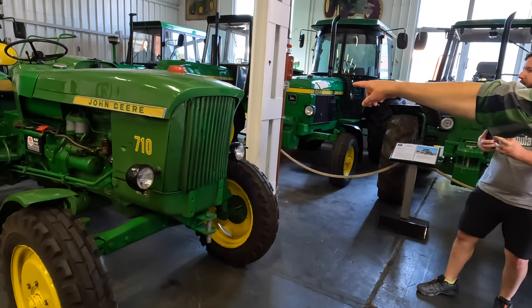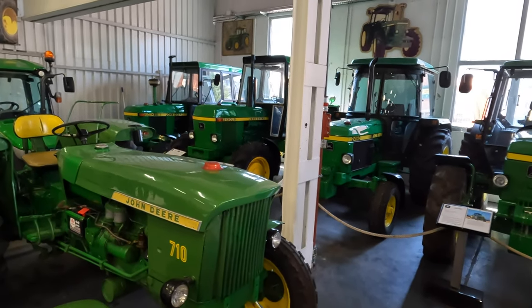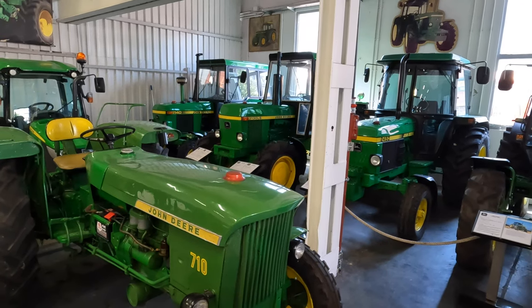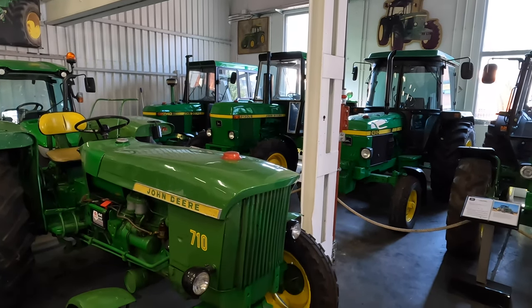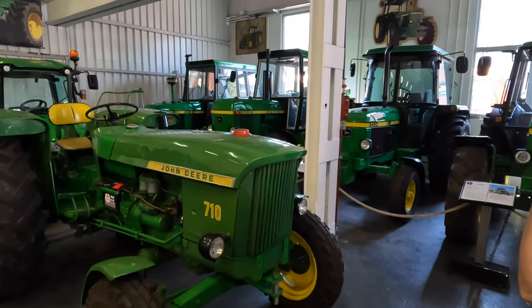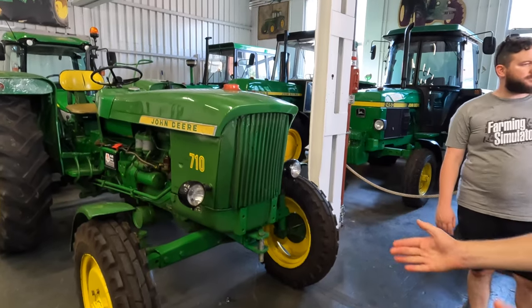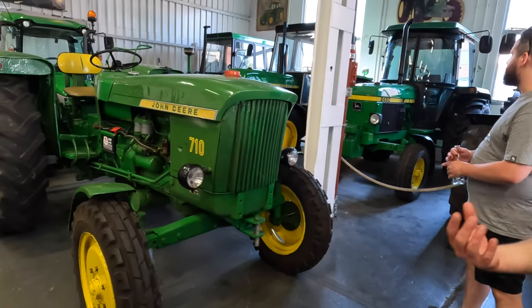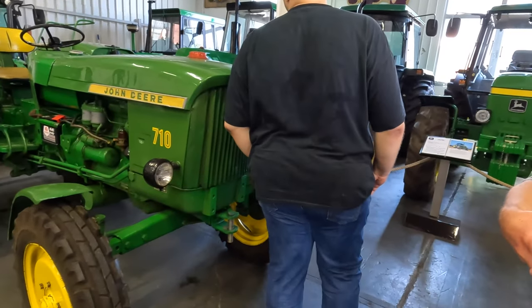You see, this was a tractor with this hydraulic front wheel drive that was not really beloved by European farmers. Yeah, because it's not as powerful as a mechanical front wheel drive. It was actually the rear axle of a combine as front axle of a tractor. You have a very tight turning radius, you have a high ground clearance, but it does not compare, like you see, in really muddy spots. It does not compare to the mechanical front wheel drive.